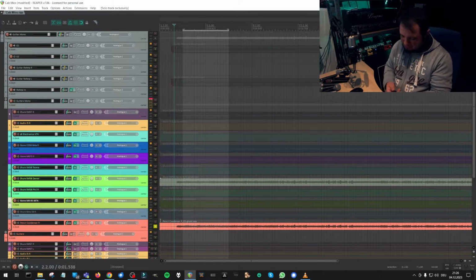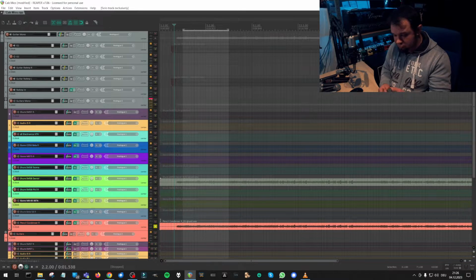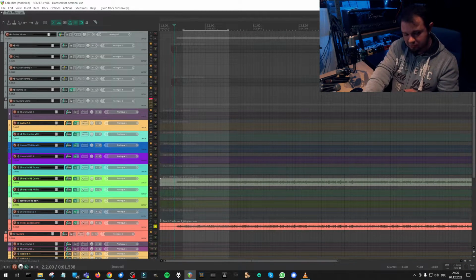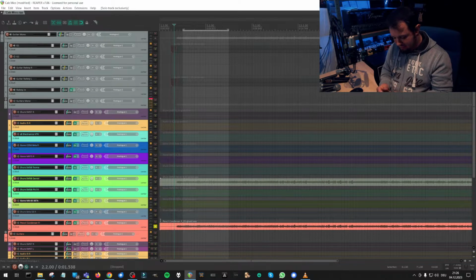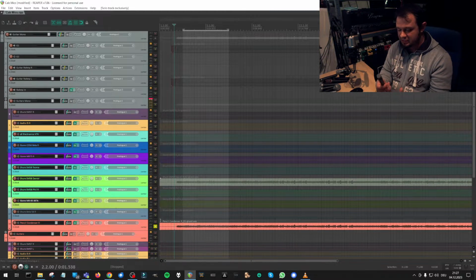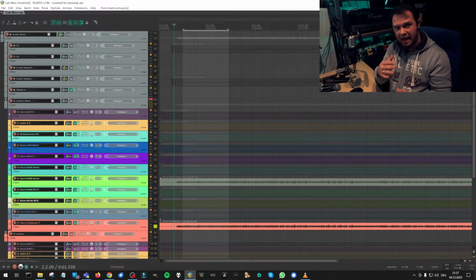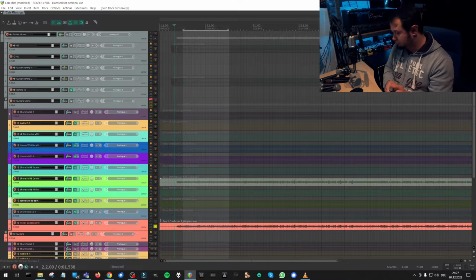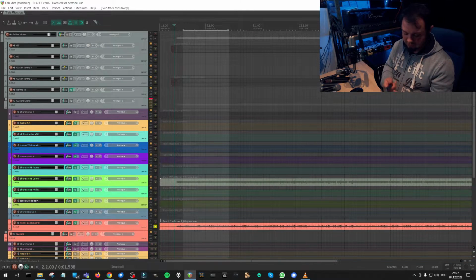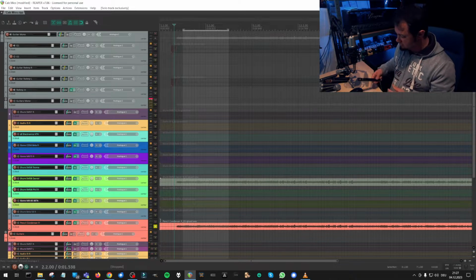Now, in my personal opinion, I had to put a 10 dB attenuation on this microphone over here through the interface, and I think it sounds kind of like the microphone is breaking apart. So the tonal characteristics are falling apart. It's not capable of capturing the nuances at that kind of high sound pressure level. So I think this is not the right choice for such an application.